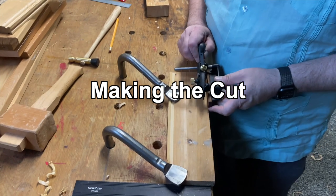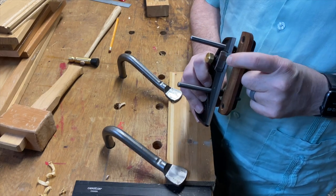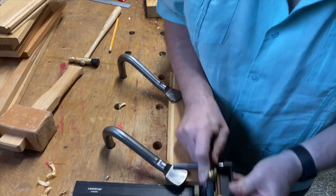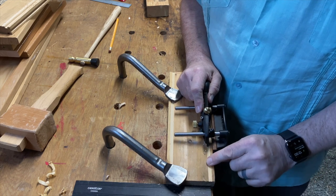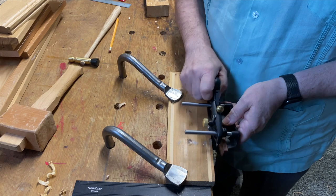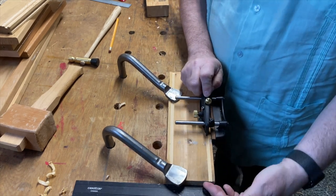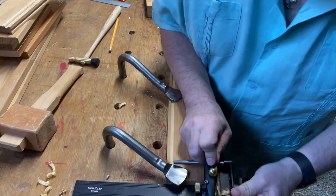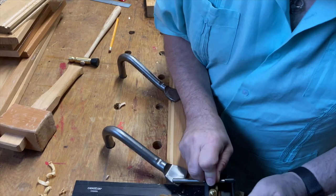Okay, we've got this thing all set up and ready to go — a quarter inch deep, quarter inch wide, quarter inch away from the edge. Traditionally you start at the end, taking little shavings and deepening your groove gradually, in order to make sure that your plane gets a good start and sits in the groove well and creates a nice line. I haven't marked this out beforehand, which you could certainly do, but with this plane you don't really need to. The fence registers very well and the plane is very positive in your hand, so you can start at the end and just start taking your shavings and you're going to get a very good line with very little resistance.